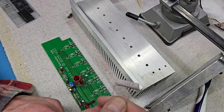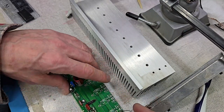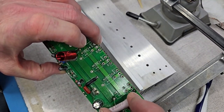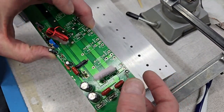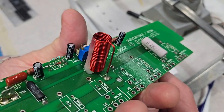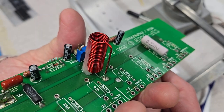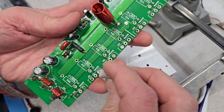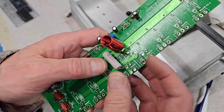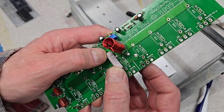One watt is just not big enough — maybe that's what was in there before. But if I want a 3-watt resistor, I'm going to have to use this one. You can see there's obviously plenty of room down here, and it needs to be off the board a little bit anyway. This was probably the toughest spot right here, right next to this air coil. I think it can be tilted over a little bit and there should be enough clearance.